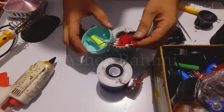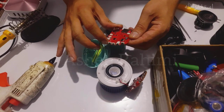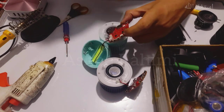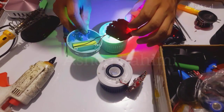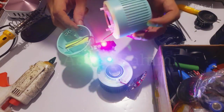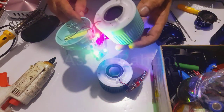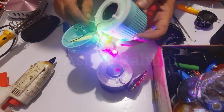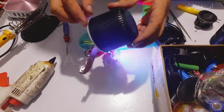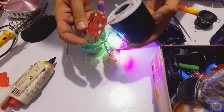Now let's switch this M4 mini speaker on. Bluetooth mode — yes! This mini wireless speaker's problem was its battery. I'm using the battery from the other M4 whose PCB was not working, and now this one is switching on properly.